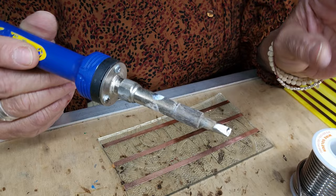I'm going to take some of my steel wool and steel-wool that off. You can do the same with this other one. You can see it takes the shiny out of the foil, which just kind of gives it a satin finish, which is fine. That's what makes that solder line take the patina better. Then push this over to the side for just a second. This one went from a real shiny line to a satin line.